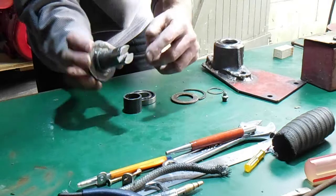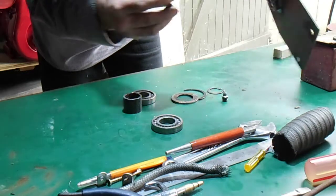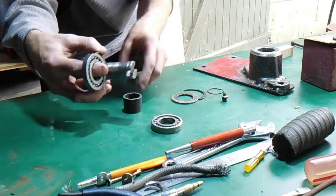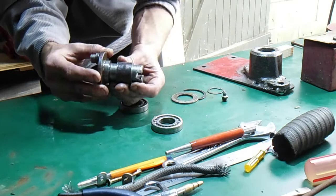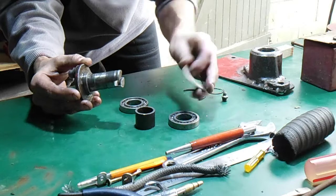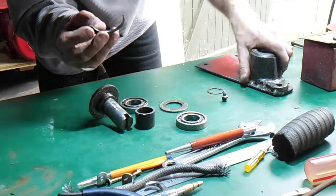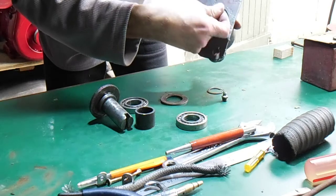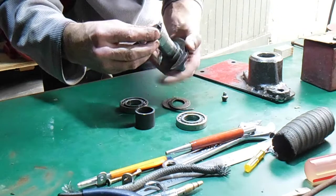Finally a result — it's apart! Very, very patient testing job, this one. So this is the shaft that came out — you can see where I've had to grind away the burr to get it out. First bearing goes on — it actually slides into the housing. Everything is pressed in. So: first bearing, spacer in the middle, second bearing on there, then the cap which went over the top of the bearing on the shaft, then a retainer clip that fits into the groove inside here over the top of that cap, and finally a circlip which goes around the outside. There's no groove left for the circlip — that's gone because of how much it was mushroomed out.